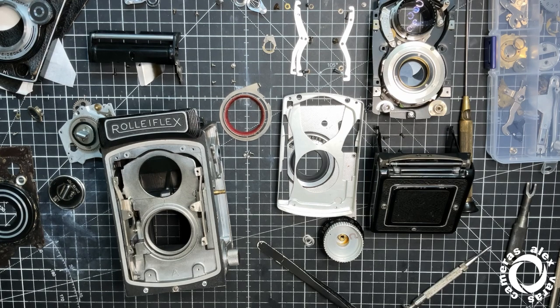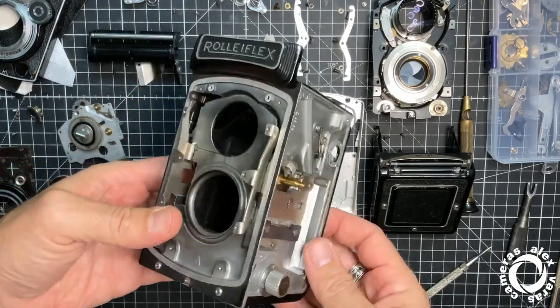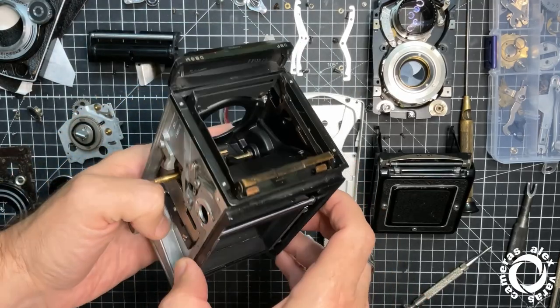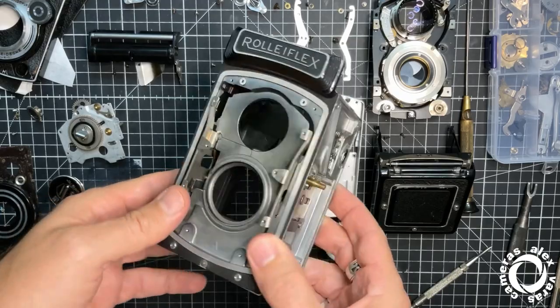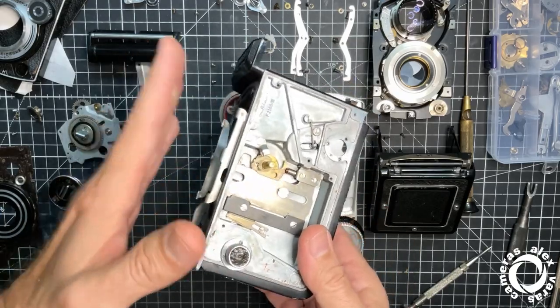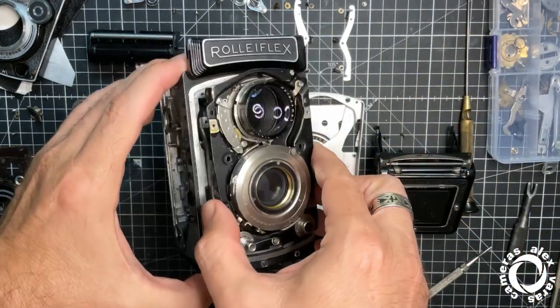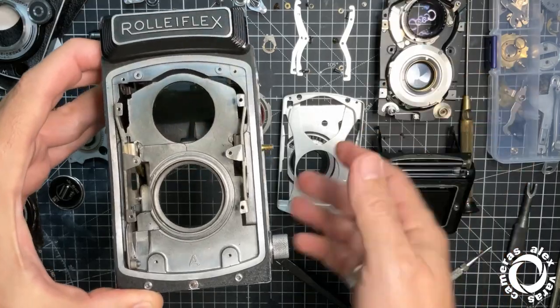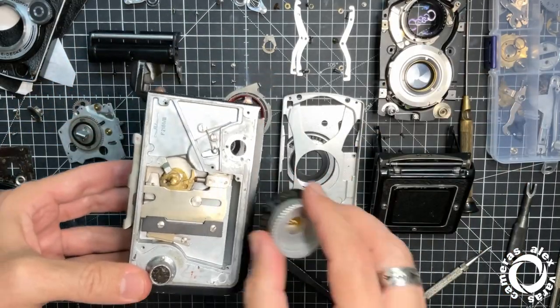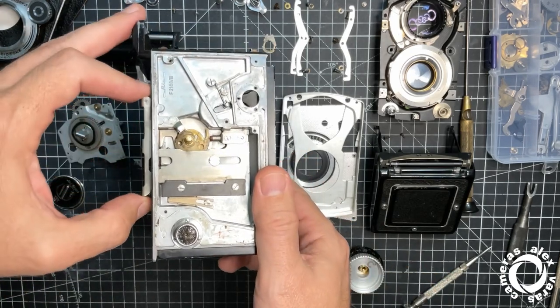I have here a 135B type 1. Here it is, basically the skeleton, nothing else. I just mounted the focusing rails, because they are quite okay. How do they work? Here you put the front panel on these ones, like this, and you move the rails forward and backwards, so you achieve the focus that way. Here goes the knob for focusing. And this is the first system of the camera, the focusing.